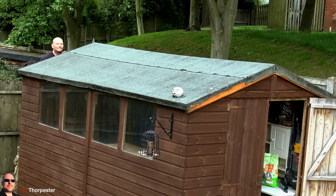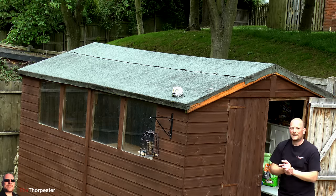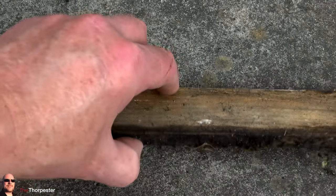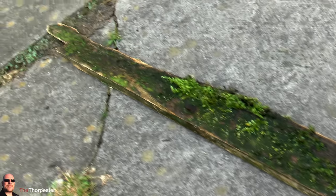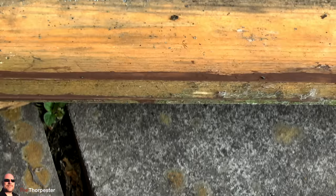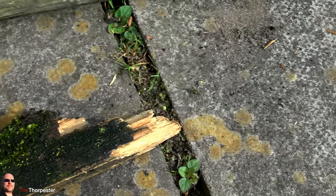I'm going to start by taking the strips of wood off the sides and pulling out any nails that might be sticking out. It's important to get all the nails out if you can, because the new felt that you put on could get caught on them and get ripped. Unfortunately these strips of wood are totally unsalvageable — they've rotted through in most places, they're covered in moss, they're all wet, and even though this is supposed to be treated wood it really hasn't lasted, so it's all got to be pulled off and replaced.